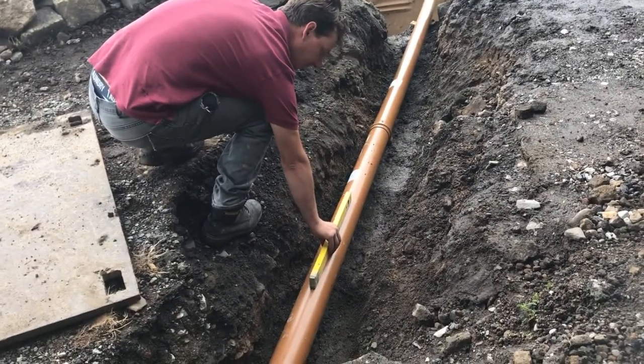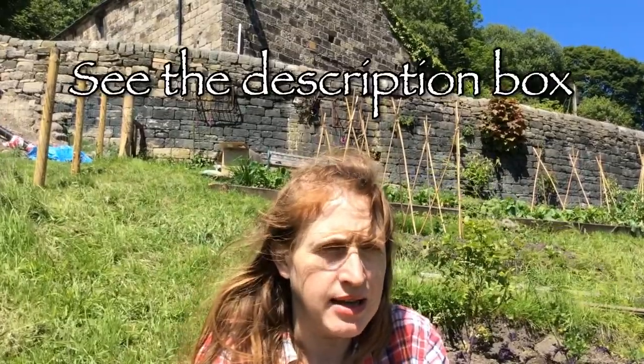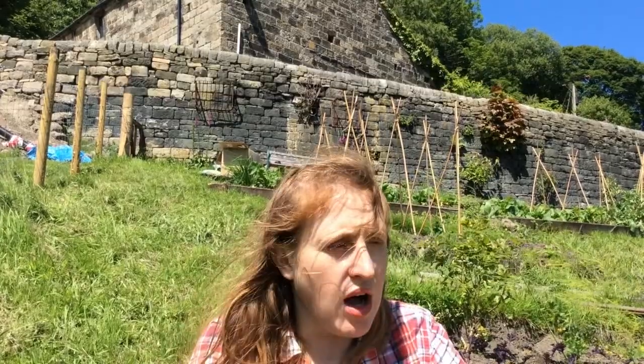Let me talk a bit about the backfill. So if you're putting in a plastic sewage pipe, you need to put in pea gravel, pea shingle, and sit the pipe in that and then surround the pipe with it. What I read in the building regulations, it's got to be at least 30 centimetres down. And if it's under a road, it has to be significantly deeper — think of it as 70 centimetres or so. Because if you can't have the depth, then you need to have concrete slabs laid on shoulders across the trench.